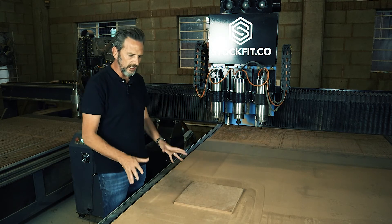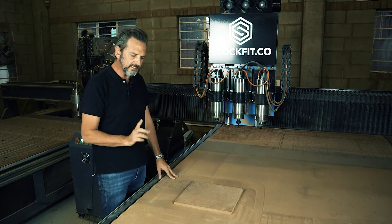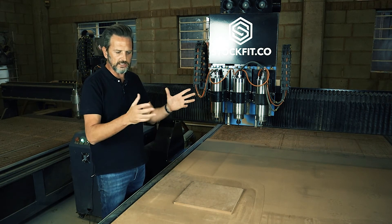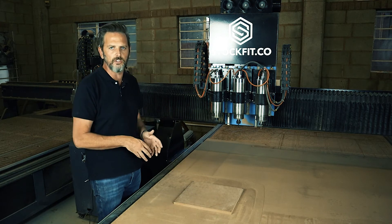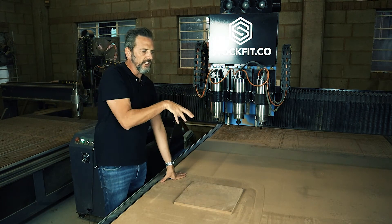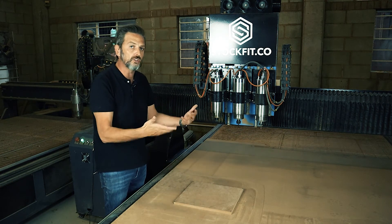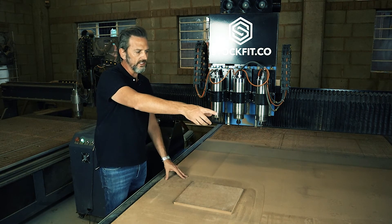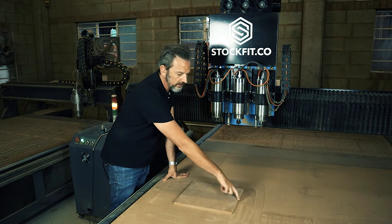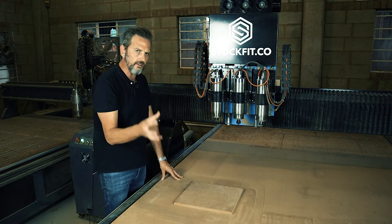99% of the time, if you're doing work on a full sheet, you can start at the bottom left corner, cut all your panels, make sure everything fits, and off you go. But in some cases you have an issue where parts move, a router bit snaps off, something happens and a part goes missing, or there's something wrong in the G-code and it machines in the wrong way. You might be left with a weird off-cut section you can use on that existing board, or some off-cuts in your workshop that you can put on the machine to redo those parts. If you want to cut from the bottom right corner upwards, you can reset that file and set your zero point to that side to make sure your panel fits in there.